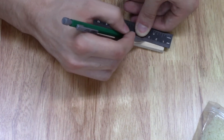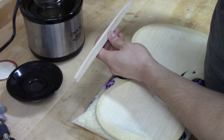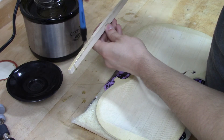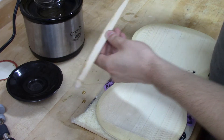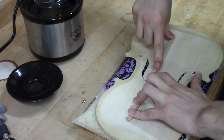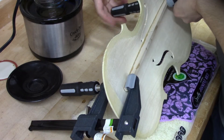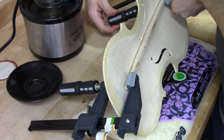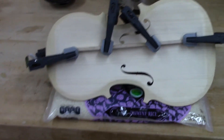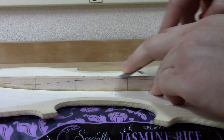This is meant to be a rough guide, but it turns out spot on. You can start to see the shape we're going for — thick in the center, tapers out towards the end. I'll get some nice hide glue on this. The resources I was using said to mix up a new batch of hide glue every time, but I can't do that for every step — it's the same glue the whole way through. Maybe I'll regret that later, but I think it will hold up fine. This is 300 gram strength. I'll hold it in place and clamp it. I only got four clamps on here — really should have more — but it's such a tight fit. That chalk fitting really gets you a perfect fit if you take your time with it, so I feel confident in this glue-up.